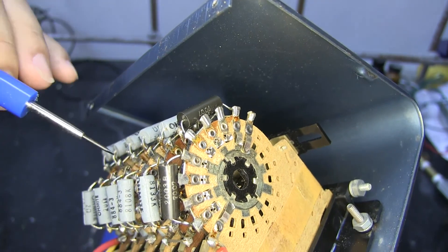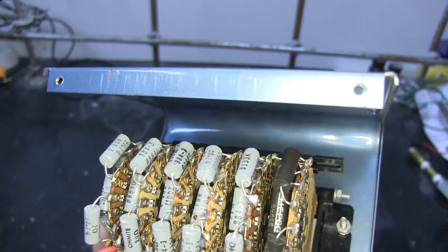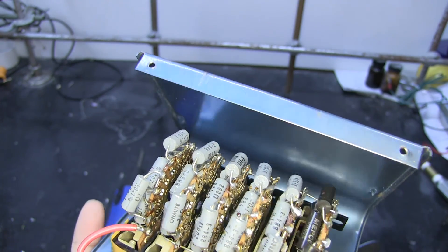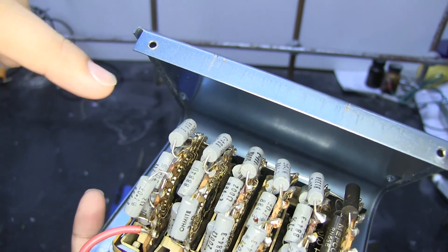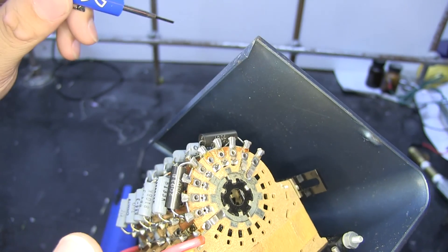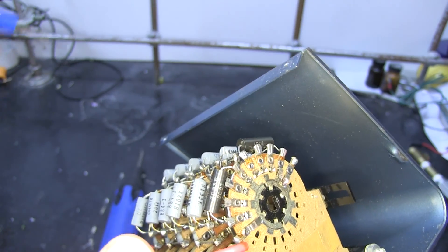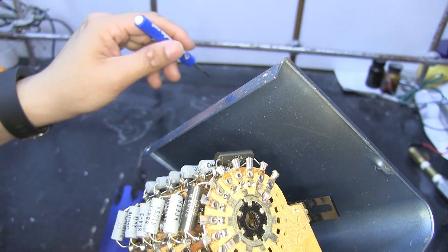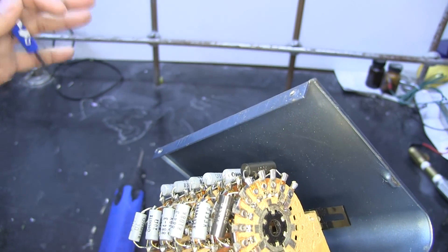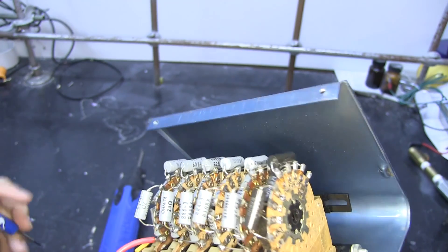It's not actually switching out to different resistor values — it looks like it's just adding on one extra resistor each time. Then it's either inserting or removing the odd number. So it's going to insert a two ohm, then insert a one ohm, then switch to one ohm for two ohm, then insert a one ohm to make it three, then pull out the one ohm and put in an extra two ohm to make it four — and back and forth. So it's only really changing the one-ohm resistor significantly; the rest are all identical.